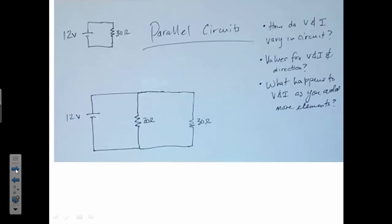Now, parallel circuits. I'm going to start with a simple 12-volt circuit with a 30-ohm resistor. Let's do a quick calculation. My source voltage is 12 volts. We need to know how to draw voltage arrows and current arrows. A voltage arrow is an open-headed arrow pointing towards the positive side of the circuit. The negative side is the other end, giving us a 12-volt voltage arrow.